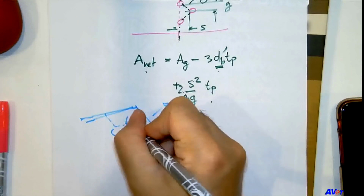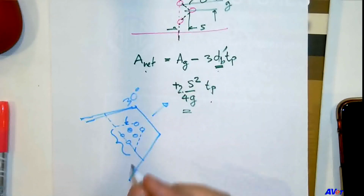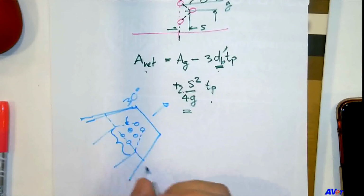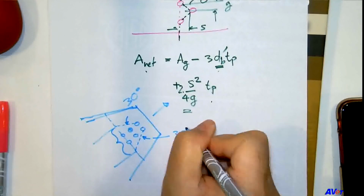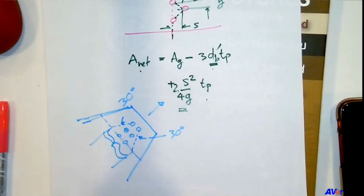And this is 30 degrees. Okay, and this becomes known as the Whitmore section. So you just project a 30-degree angle onto the end of the connection, and there you have the Whitmore section, and consider the yielding over there. Okay, these are examples of some of the things that we may need to consider, in addition to the basic failure modes that we have.